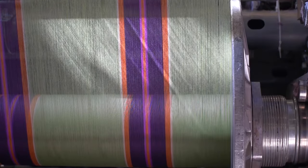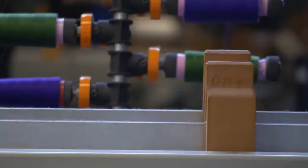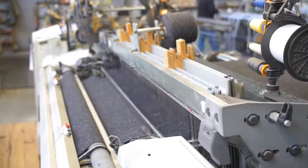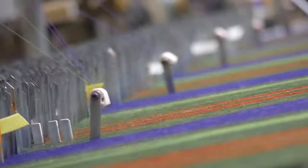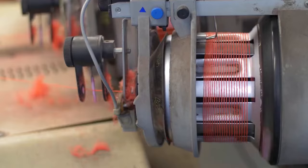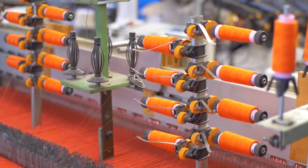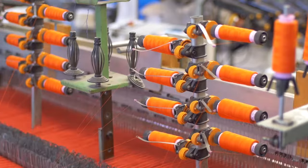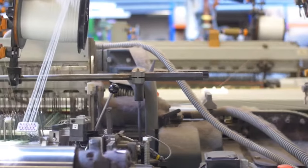This allows the warp to be drawn through the loom. Each thread goes through a series of shafts, and when the loom is running you'll see some shafts go up and some go down. The ones that go up lift threads and the ones that go down take threads down. That creates a gap, and at the front of the loom you insert what's called the weft — the yarn that comes in from the side. Each time a thread comes in, the shafts change again and you get a different selection of threads going up and down, each time filled with a thread going across, which is often referred to as a pick. That is your weaving process.